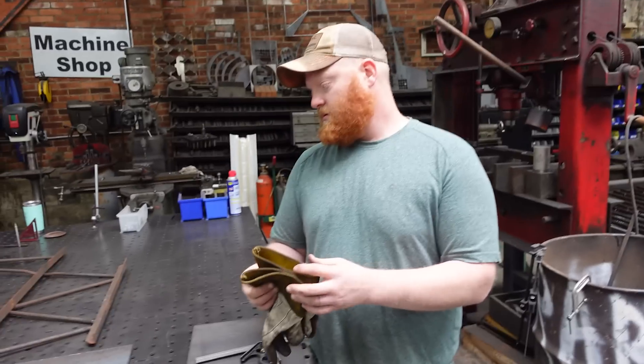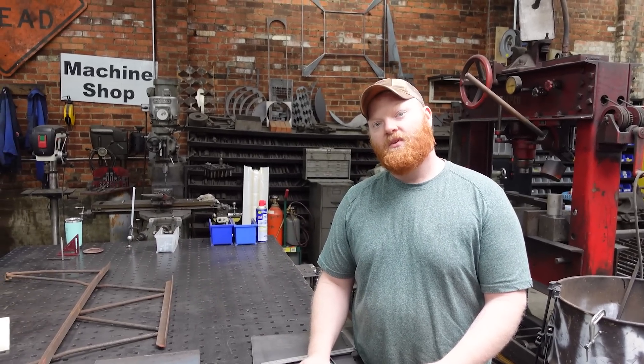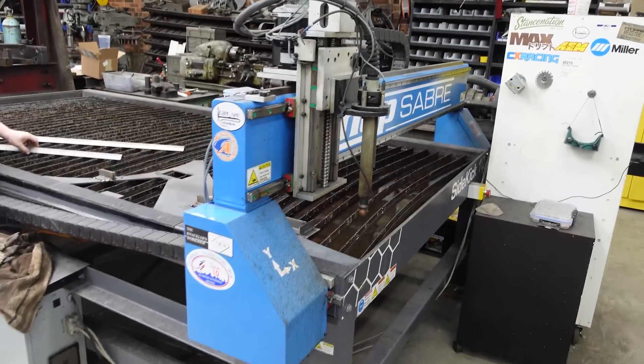Because I've done this once or twice before on the plasma cutter, I figured this would be a perfect time to use this technique. Here's our 5x10 ShopSaver plasma table, and here's a piece of scrap metal I pulled out of the bin. The plan is to put one of each piece of angle — a short piece and a long piece — in this jig, flange side up, and basically drill all our holes with the plasma table.